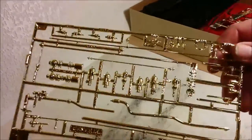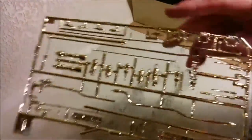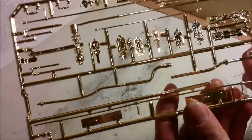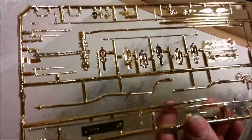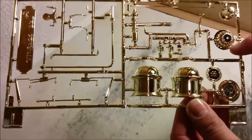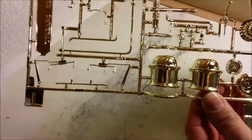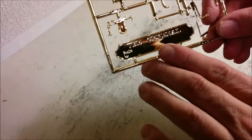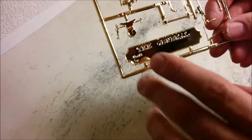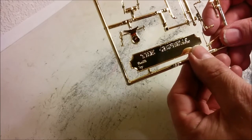Here's the first of our brass sprues and it doesn't appear to be any flaws or anything in the finish. There doesn't seem to be any flash — there's a little bit on the sprue itself but not on the parts, which is important because otherwise you're not going to be able to touch it up. Here is the steam dome and the top of the sand box, the bell, along with some of the other bits of plumbing. And this is the name plate which goes on to the base. Down here it says 'built by' and you can put your name in there, which is kind of a nice touch.